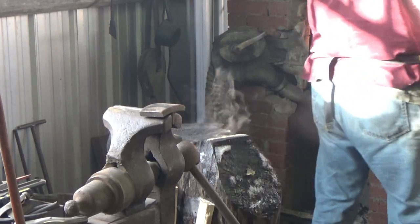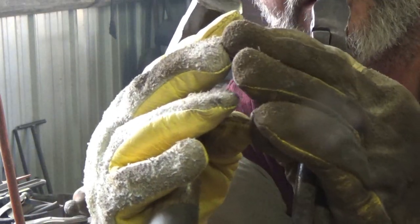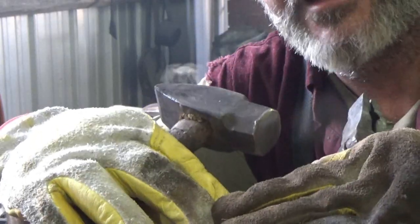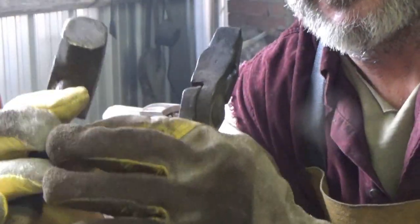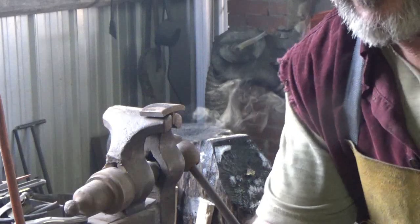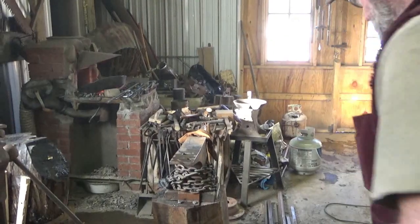Because the steel is pushed up, when it's hot, when I hammer, because the rest is cold, instead of flattening back out, it should compress, upset, making it shorter. And then you do it to the next spot and compress it. And by shrinking those pieces all the way around, you end up shrinking the diameter. I'll be back in a little while to show you how it works. I'll show you the technique I've adopted.